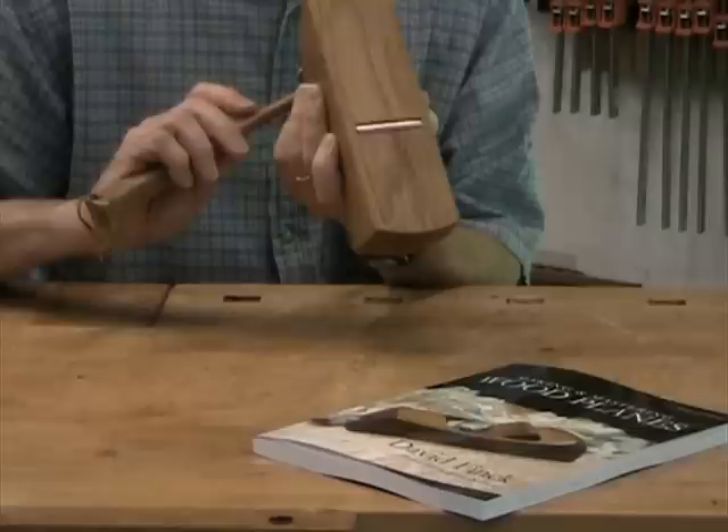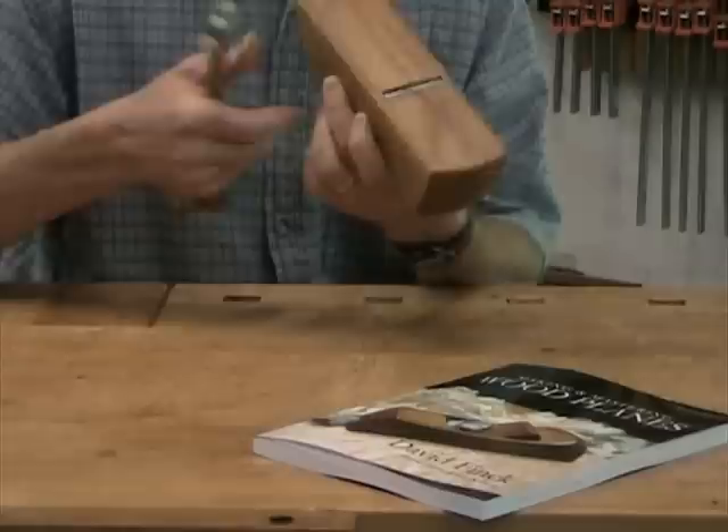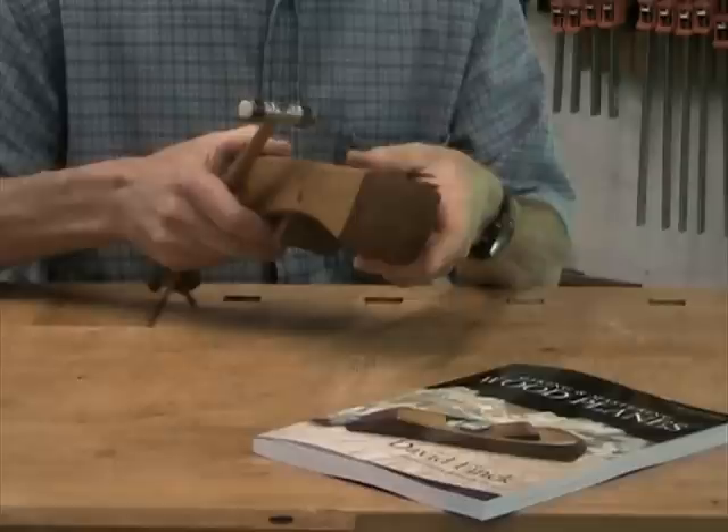Now, for the very final adjustments, I'll tap the blade forward once again. After each adjustment, I'll feel at the corners to feel if the blade is protruding out the bottom. So that looks about right. I'll just feel with the thumb for the corner of the blade — do I feel it or not? I feel it ever so slightly on the left side, but not on the right. So I'll bring the right corner forward by tapping on the right corner of the blade. That will bring both forward, but the right side a little more. And that feels about right now, so it's time to try to take a shaving.